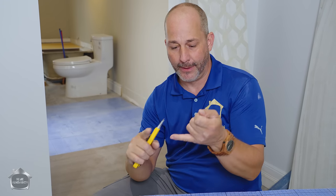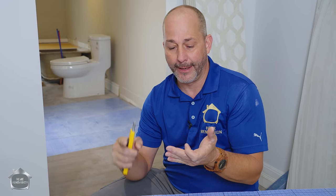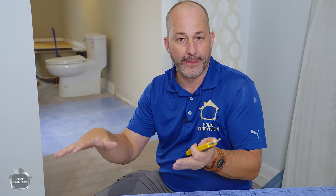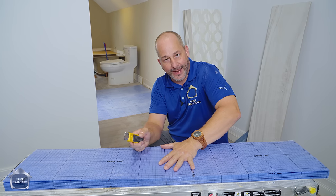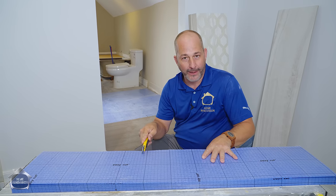The other major problems we have with floating floors — luxury vinyl, laminated plank, floating engineered hardwood, SPC, WPC — whenever you're installing this, one of the biggest problems in older houses especially is if there's a slope on the floor. Because we install those floors with gaps for expansion and contraction, they tend to slide to one area over time with traffic, leaving a huge gap at the other end. This product has a slip-resistant layer so the flooring doesn't slide. That's one of the reasons I love it in my old farmhouse.